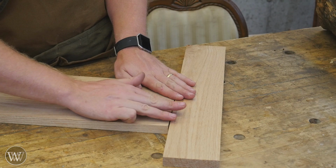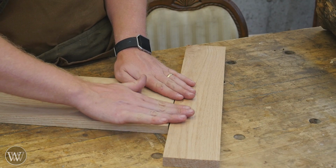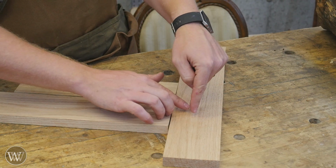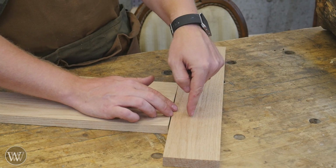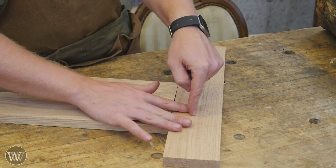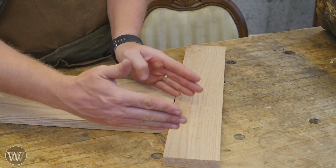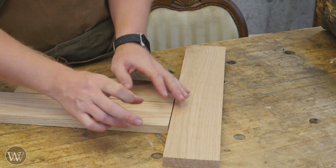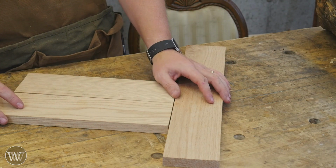But all the other tenons, we make the mortises bigger so that the tenon can move around inside. Or if we put a pin through, we make the hole in the tenon so that the pin movement can be handled. And as it gets farther out from the middle, that space becomes larger, so it allows for more movement the farther out from the middle it becomes.